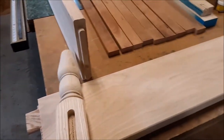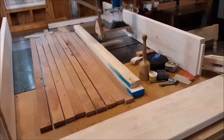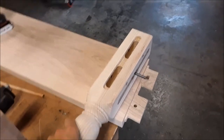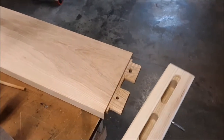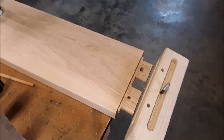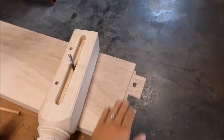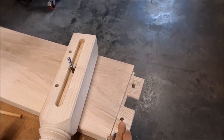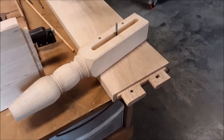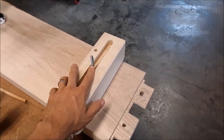We'll do that at each corner and this bed will be stout without any glue. The joinery is all ready for assembly — twin crenelated tenons and mortises. The holes are pinned, with one elongated to allow for wood movement from bottom to top, and this hole we're going to draw-bore just a tiny bit to pull that shoulder nice and tight. Since we're not using any glue, holes are drilled and the hanger bolt is already set for the side rails.